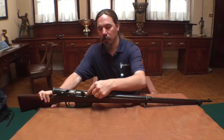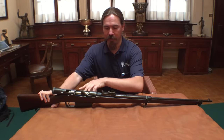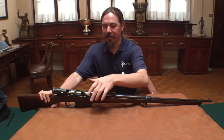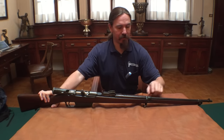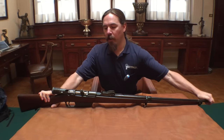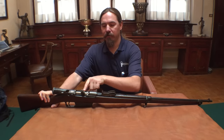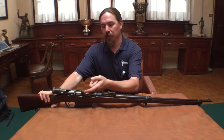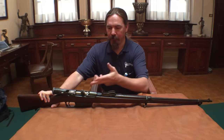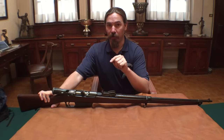What we have here is a little lug that is fixed to the frame, to the stock and the magazine assembly — that all stays in place. It's just the barrel which slides in these barrel bands. When that goes backwards, this lug interacts with a cutout in the bottom of this bolt and forces the bolt to cam upwards, which is a clever way of forcing the action to unlock.